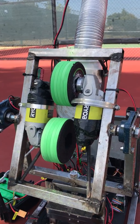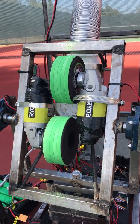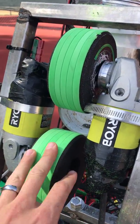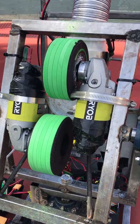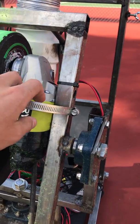I've got some 5-inch diameter bench grinder wheels attached to the 5/8-inch bore. I got some rubbery Livestrong generic bracelets stretched over them to give it a better grip. The angle grinders are bolted to the frame, and these hose clamps are just for adding stability.